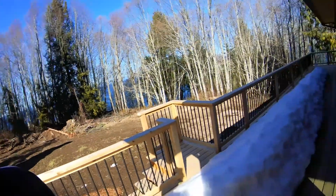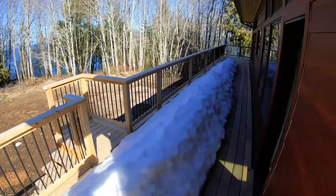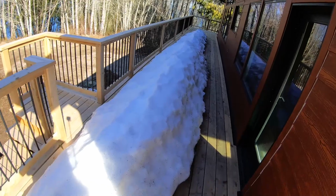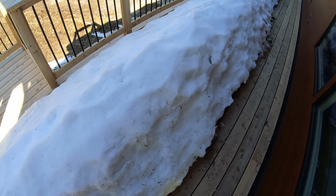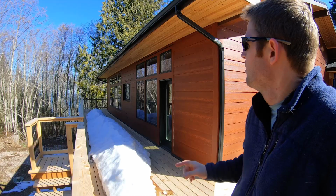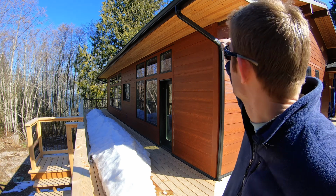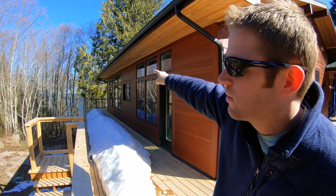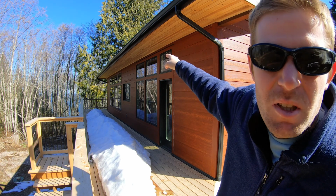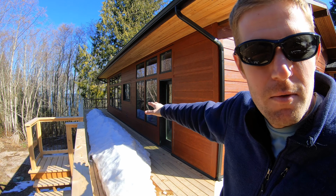So there's still quite a bit of snow on the ground here, but the vast majority is melted because I was planning on getting to those can lights here. I think that's like solid rock. Take a minute here and figure out where these lights are gonna go and how many I'm gonna put. I'm thinking maybe 5 can lights and just equally spaced, the outside ones being right up in the corner, and right up over in that corner too. And then they would be about 16 feet or so in between each of them.